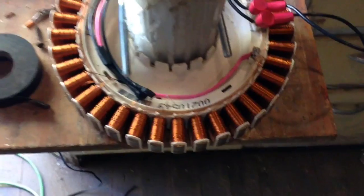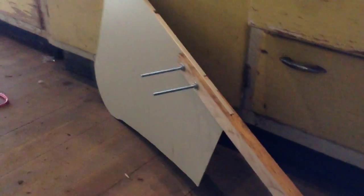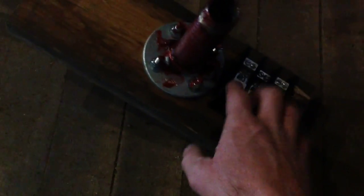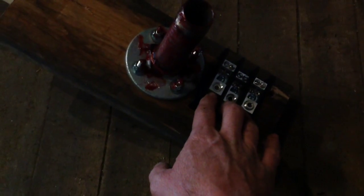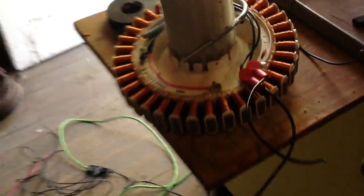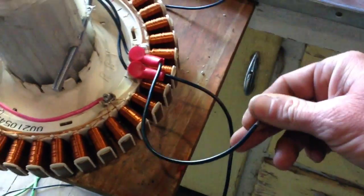Then we'll go ahead and get everything mounted back up. Here I got some grease and put it on here. You'll notice I put a lot bigger tail — the tail that was on there wouldn't catch the wind, so I found a piece of sheet metal laying around and cut a tail, which now works great. And then I mounted a little three phase lug here I got off of an air conditioning unit, so I can take my three phase back here to the bridge rectifier, nice and easy to take apart. Also here on the stator, these three wires are also tied to that lug, so it's easy to take apart if I need to do some modifications.